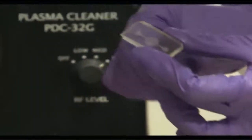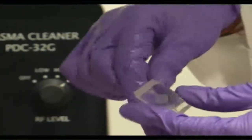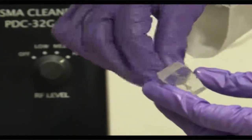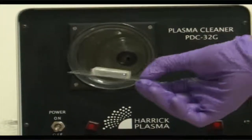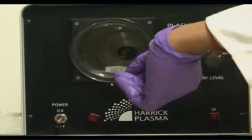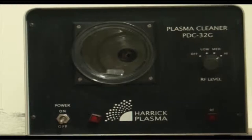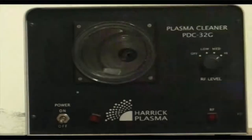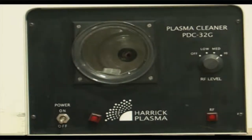A similar drilling is done on the other side for ensuring that the device is connected to an inflow and outflow port. So you now have actually a device with inlet outlet ports. Okay, we want to irreversibly bond this wafer by exposing it to plasma, oxygen plasma. This is a Harrick plasma etcher, which is very commonly available in laboratories, to make an RF, magnetically enhanced laboratory level plasma.